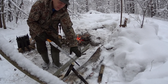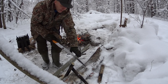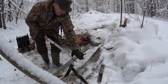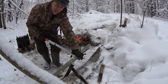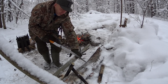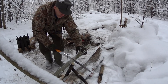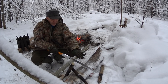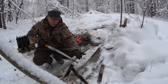A buck saw or bow saw has a really bad tendency to jump when you're starting the cut. Holding your hand close to where you're starting is very, very dangerous. I had a colleague in Denmark who cut himself really badly with a jumping saw — that was stitches, serious injuries. The push action saw can be a little dangerous in that way. With the pull action, you have really excellent control of what you're doing.